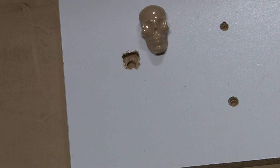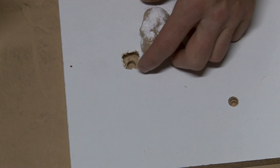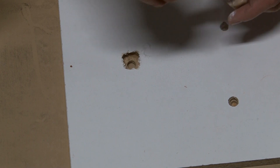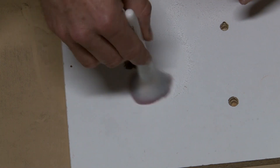That hole in my board is where the back of the skull is going to go, so that way the skull will lay flat. When I pack the sand, the skull will pack into one half — that will be the drag. Then the little nub on the back that I'm going to drill out and thread — that's going to be in the cope.